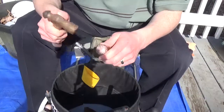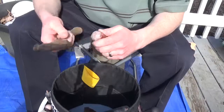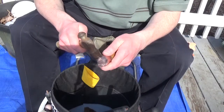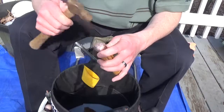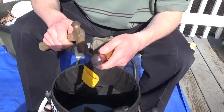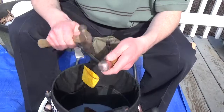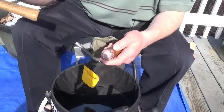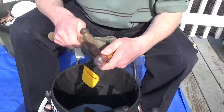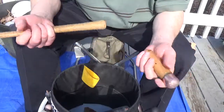So that's what you want to do to keep your billets in good shape. Sometimes I like to take a pass at a little bit of an angle on the sides, just because when you hit the hammer down there, sometimes it'll push the copper down — this way you can kind of re-disperse it. Because that's really what you're doing, you're just re-dispersing the copper that's there. That's why you have to be so careful. When I first did this, I hit too hard and knocked the tip of my billet right off — I had to Gorilla Glue it back on. Once you're satisfied that you've got it back in working order, you go on to the next billet.